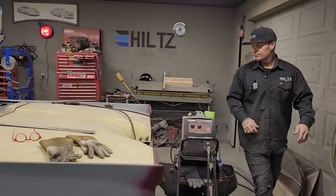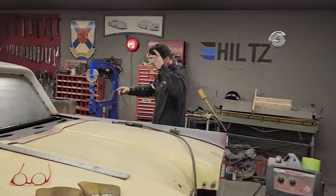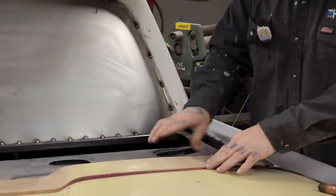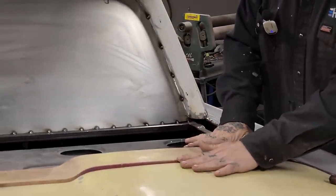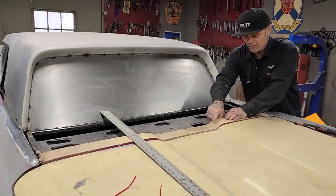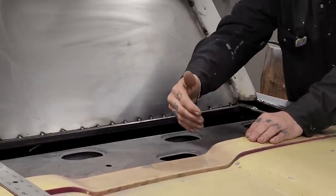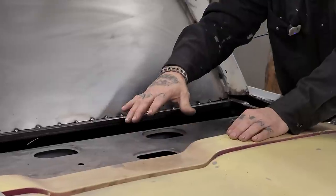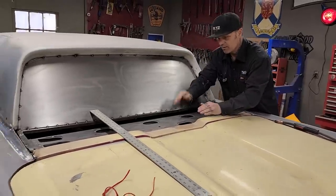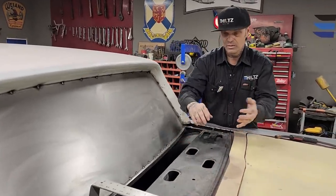So I'm going to make a sail panel, but a little bit different. I've got a piece of round rod here now for security to weld this piece, so there's something strong there. I've got this piece here to come along the back — that fits the trunk lid and seals everything off. When it comes to this piece, I'm going to put a piece of exhaust pipe — cut a piece of exhaust pipe in half and run it from here up to there. That gives me structure in the middle of that. If I run one piece all the way across, I really have no structure for a nice piece of metal to go in that sail panel. So I'm making it out of two pieces of exhaust pipe, then panel, panel, panel — five pieces total.